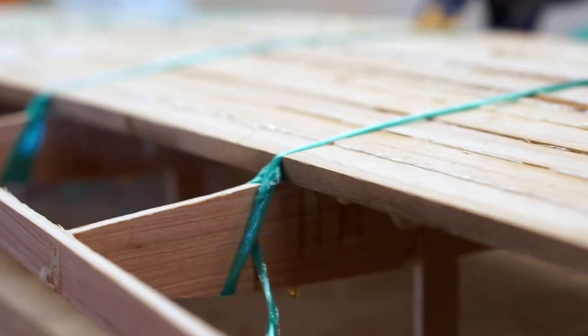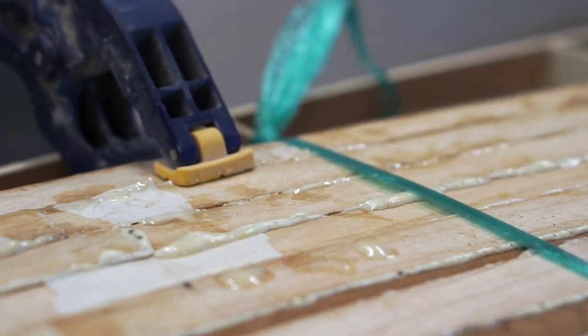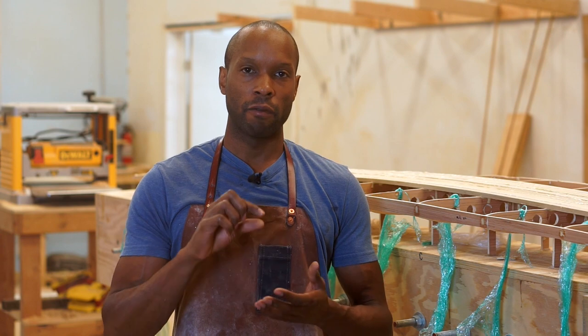As far as gluing those down, you'll glue together all of the strips starting from the middle, working out towards the outside. The process will be the same for both the top and the bottom of the board. The width of your strips or the design or patterns may differ, but the system for gluing those down should be relatively the same regardless of what model of our DIY kit you're building and regardless of what type of wood you're using. You may notice when gluing it down that not all of the strips are perfectly flush with each other on the top — that's okay. There may even be a little bit of glue squeeze-out as well, and that's also okay. The entire surface is going to get planed down and sanded down to a nice smooth final finish, which is why you want each one of your strips to be a little bit proud of that final thickness so that you have a little bit of meat to work with when you're planing that down.